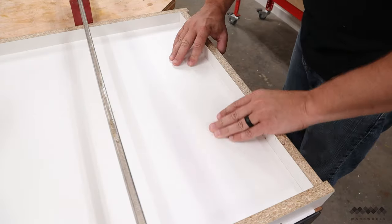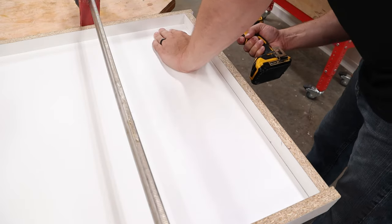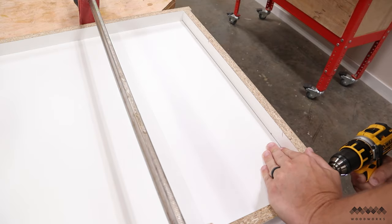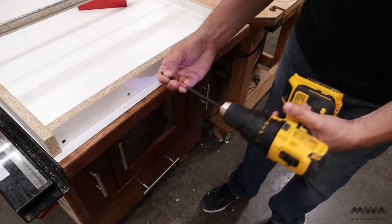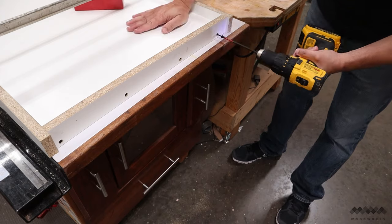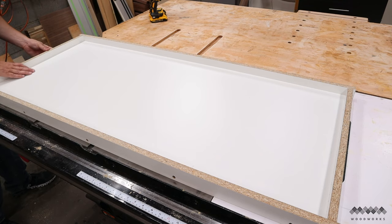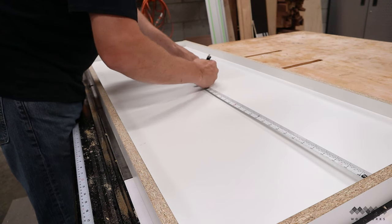The sides of the mold are going to get screwed into the bottom versus the other way around, which would make it a lot harder to demold. I'm pre-drilling these holes because you don't want to screw directly into melamine without pre-drilling — it's super easy to split. You can cause humps in the melamine, and all those little imperfections are going to show right through into your concrete top. Once I get everything screwed together, I check all my seams for tightness. Then I lay out for the two holes to accommodate the faucet and sink drain.